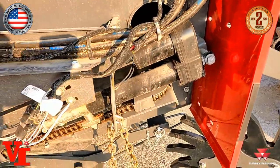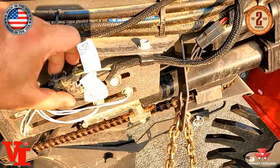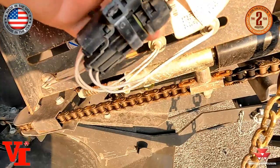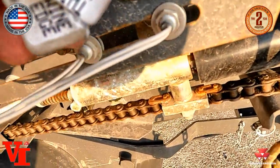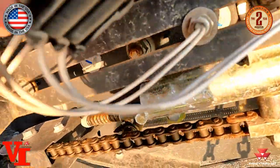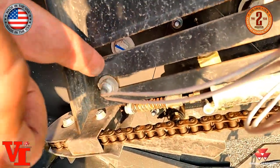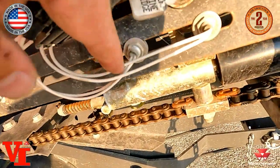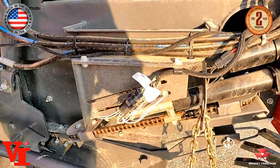This is the electric threader. You have three sensors, and if you look right here on the tags, you're going to have your home position where the twine home is right here. This is going to be the right edge — the second position sensor there — and then your left edge. You can adjust these to wherever you want the twine. If you want the twine a little closer in you can bring it in here, same thing with here, and then this is going to be the home position — it's going to tell you you're ready to bale.